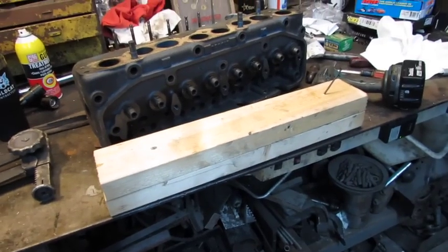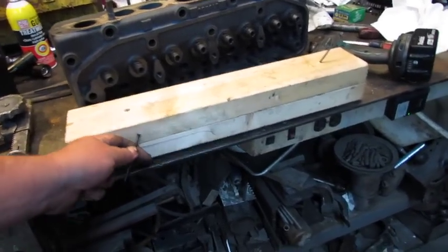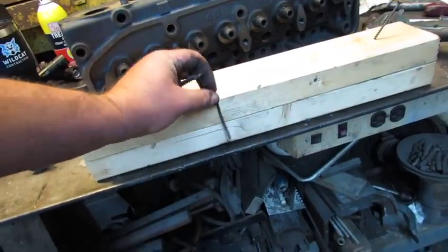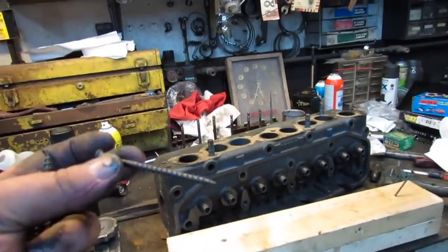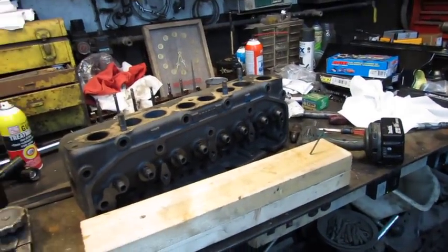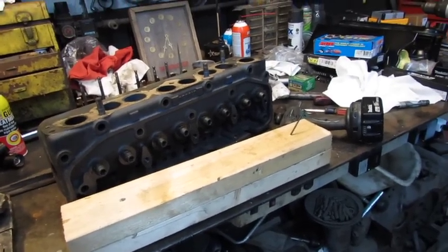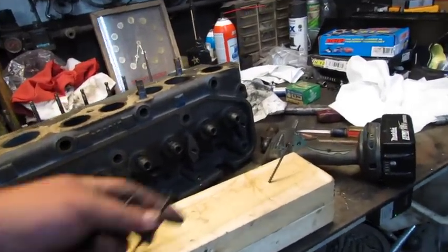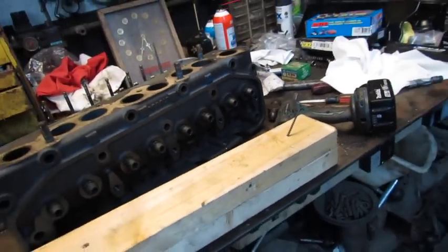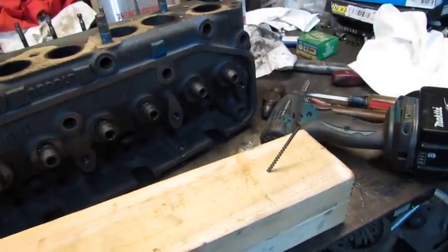You gotta pop that one in so you can get them out. Say you're the kind of guy that works in construction, scabbing stuff when you can, and you've got a bunch of screws that are just a scotch too long. Well, you could go get your grinder after you put them in - they poke out the other side, grind them off - or you could put them in on an angle and then it won't poke through the other side. I'm just saying some of you younger fellers might can use that tip.